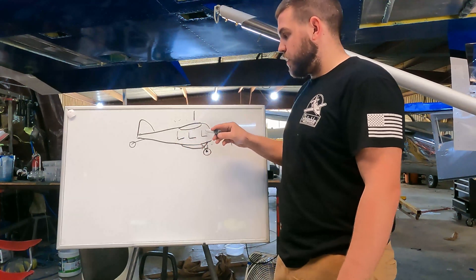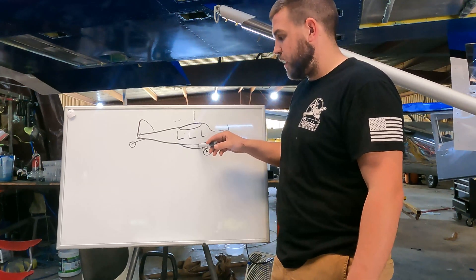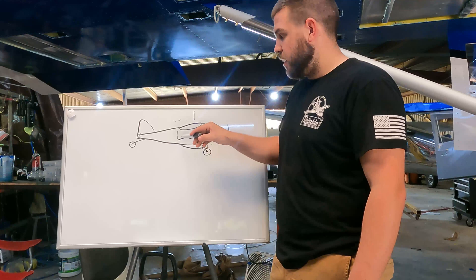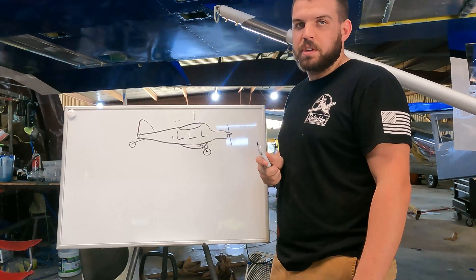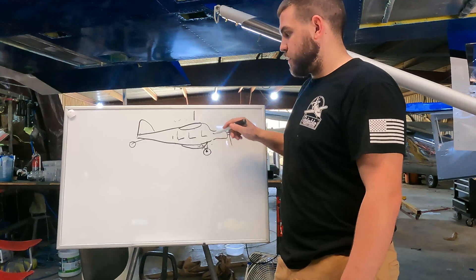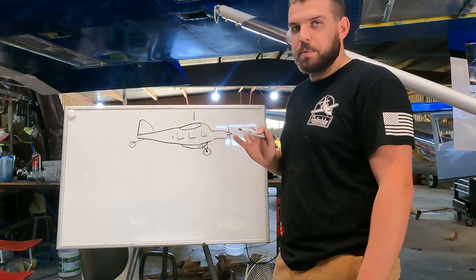When you're a single pilot flying along with a little bit of fuel, you may take that 25 to 30 pound toolkit that's normally in the belly pod, throw it all the way back in the baggage compartment, and your CG is right where it needs to be. That's where we want it to be building-wise. But the purpose for doing the belly pod has a couple of reasons.